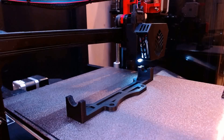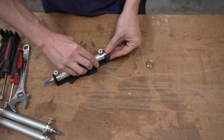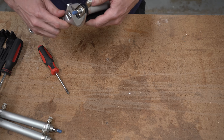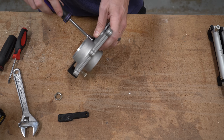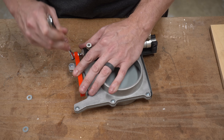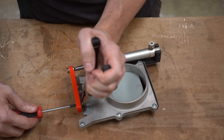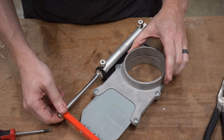I designed 3D printed holders that mount to the edge of the blast gate and hold these in place. On the end of the threaded rod is another 3D printed part that attaches to the folded part of the gate with two screws. These will keep the cylinder secured and aligned so the gate doesn't bind over time. The cylinders then connect to six millimeter tubing that goes back to the main unit.